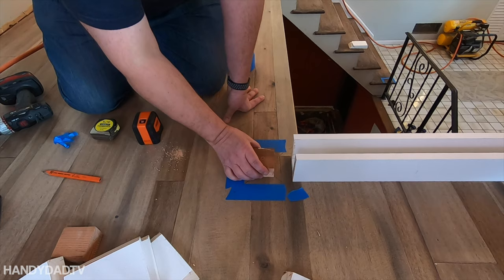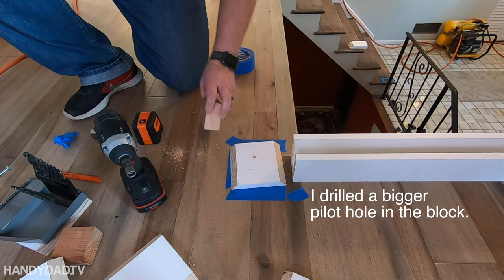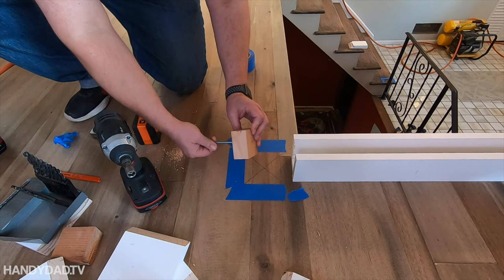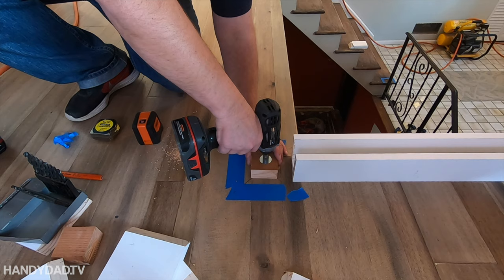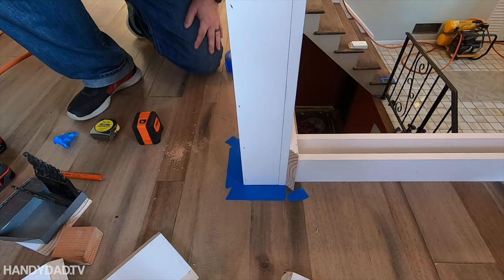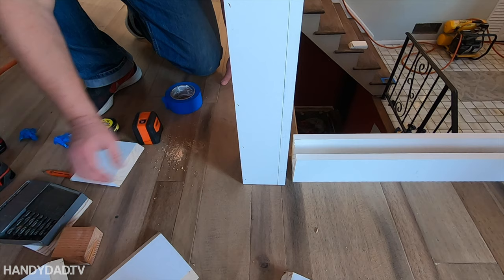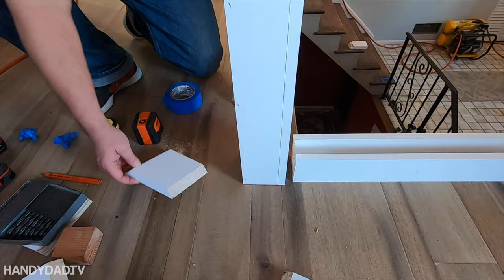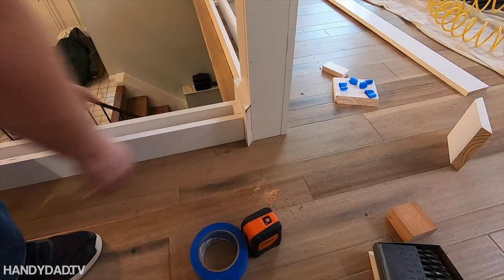To attach the post to the floor, I used a 2x4 and cut a block that fits inside the post. I drilled a pilot hole through it down into the floor and used a 6-inch lag screw to attach it nice and tight. It probably didn't need to be such a long screw, but anything worth doing is worth overdoing — I wanted to make sure it wasn't going to go anywhere. Then I put everything together loosely, and eventually I'll add the pieces for the base on the two sides where the bottom rails are, with the spacer block between them.